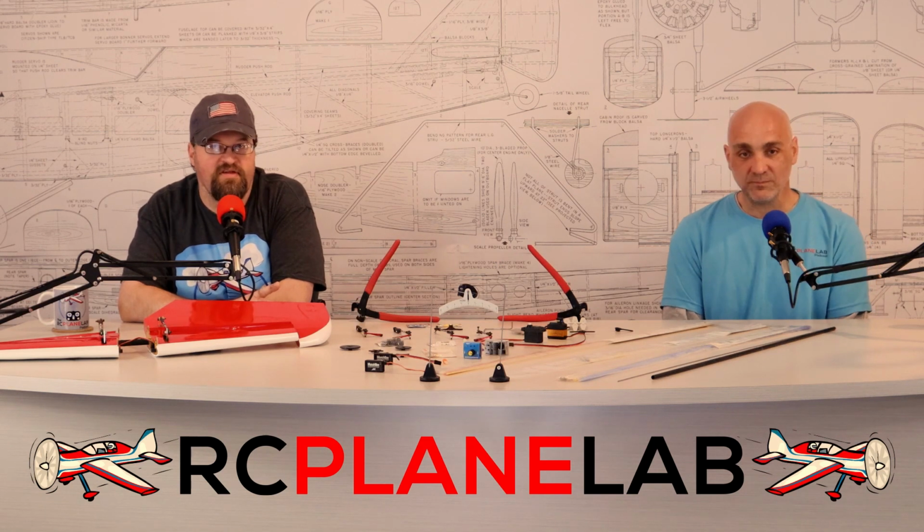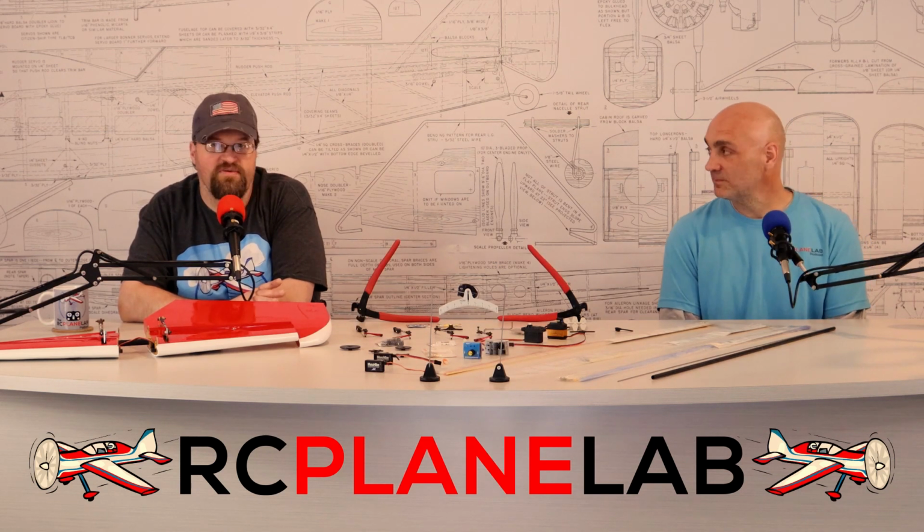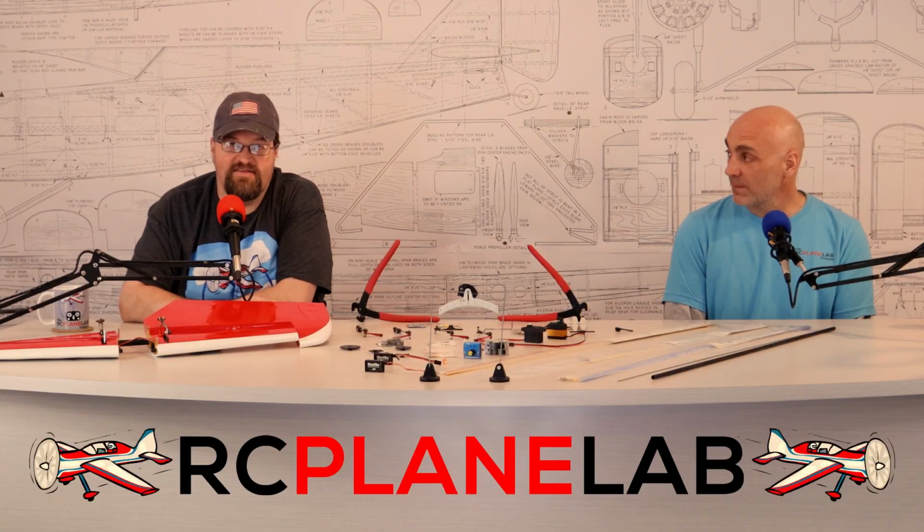Okay, so the servo's centered. Now we want to make our connection. Hold on, before you go, I like what you said there about how to do that, but my issue with doing it that way is, have you ever tried to hook up a servo that has no power to it, so it's not trying to stay centered, and has no way to keep itself centered? It's very easy to knock that out of center and not know that you did that.